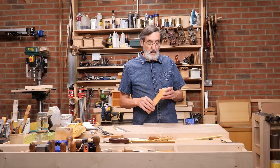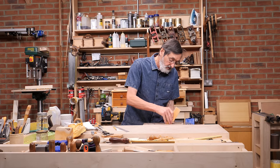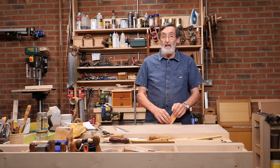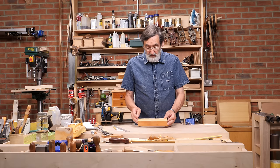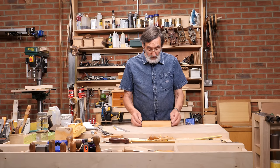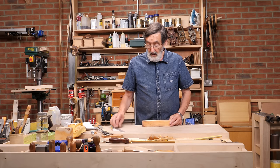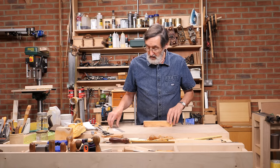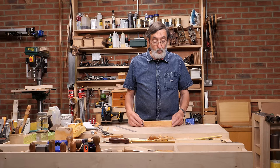The reason I did it is because when you're making this knob, you need to stand it in the vise and start shaping it and giving it the shape, and you need that extra length, otherwise you don't have anything to hold on to. So that's the reason I've done it, and I think you'll find this a very, very interesting exercise, and it is going to be demanding, but I really think I said this in a previous part, I believe in you and I believe you can do it, and it's well worth doing.